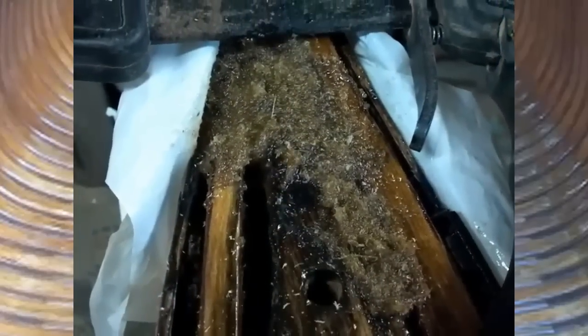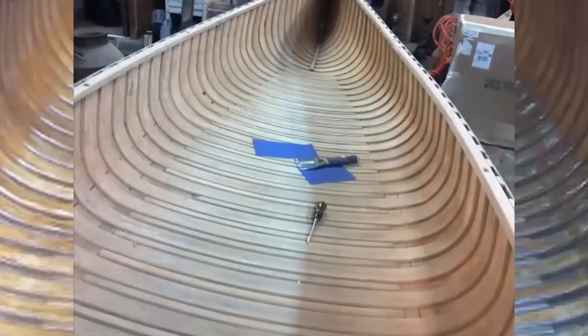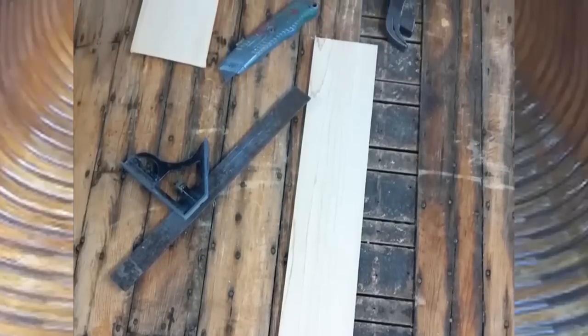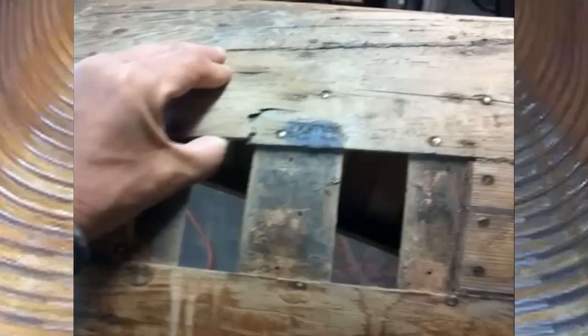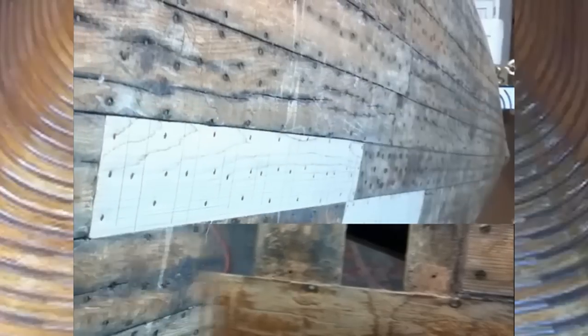All the work I've done on this end, I've got to start all over on the other end. I've got a mixture of sawdust and West System epoxy again. And while that's curing, I've got plenty to do inside the canoe — there's all kinds of sanding and scraping to be done. I also flip the thing over, strip off some of the planking, and replace some of that. It just goes on and on. It turned out to be quite a project — I was surprised how long it took.